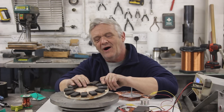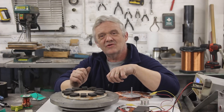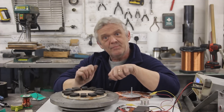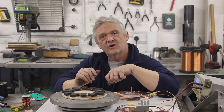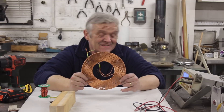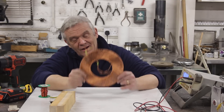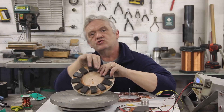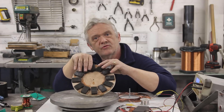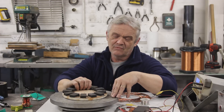What you do next is take one end from one coil and the other end from the other coil and join up the opposite ends. It's really easy to find out which ends they are — just get a magnet and run it over. If you've got a clip on it and it doesn't generate anything, you've clipped the wrong ones together. Check it for continuity, clip two ends together, run a magnet over it, and make sure it's generating something. Then just fasten those two together. What I've done is reversed one of them so that when it comes from south to north and this is going north to south, instead of fighting it, it adds.